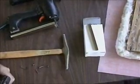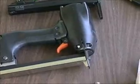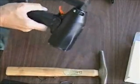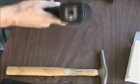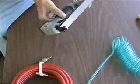Here's an electric upholstery gun that shoots fine wire staples and will penetrate hardwoods. Most electric guns sold at hardware stores aren't powerful enough and shoot too thick of a staple for upholstery work. You may be better off using tacks.